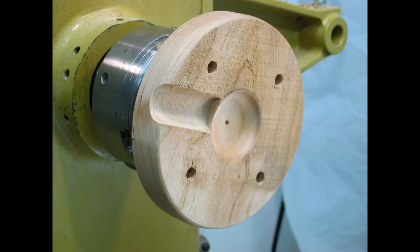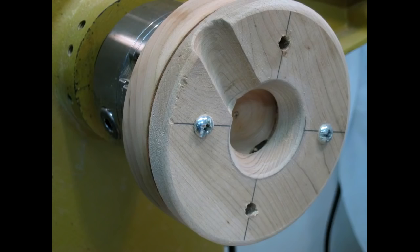This chuck will accommodate scoop balls ranging from about 1 9/16 inch to 1 3/4 inches in diameter. Do not hollow more than 3/8 inch deep. Cutting deeper can cause the tenon to fail. Reattach the donut to the back plate, but reverse the donut so the interior face is now out. Begin in the center and remove any remaining wood from the previous hollowing.